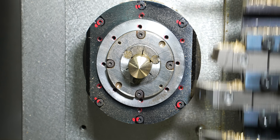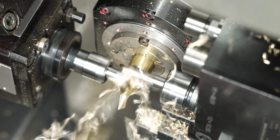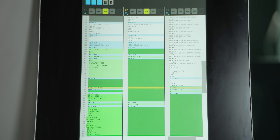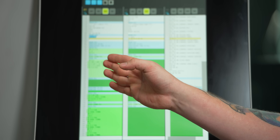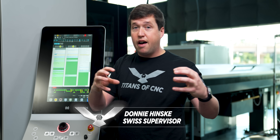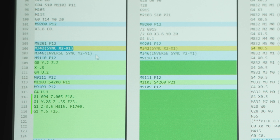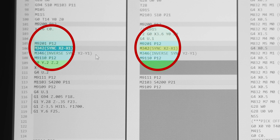Let's start by talking about synchronization. When you watched the double end mill come up and make that weird evil knife-looking thing, that was synchronization — nothing was superimposed. Everything you're watching is actually following one program. There are three separate groups of controllable axes, but once I synchronize them together they're all just gonna be on that bus like passengers along for the ride.